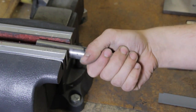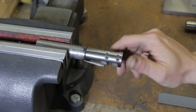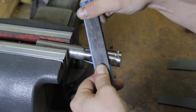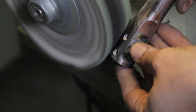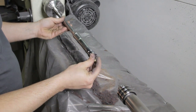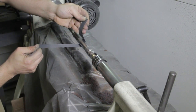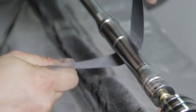With our receivers finished, we move on to the compensator, which we fixture up on a barrel stub for easier handling. Because of the shape of the comp, we have to do some initial hand polishing that can't be accomplished when we take the barrel to the lathe. Gradually we work our way up to higher and higher grit sandpaper across the surfaces of the comp, taking care to polish out any long striations or tiny blemishes. Lastly, we take the comp to the buffing wheel and polish uniformly until we reach a mirror-like finish. With the comp timed up to the barrel, we can then move to the polishing lathe to bring the entire assembly up to the final mirror finish of the presentation grade treatment. We'll also be spending extra time on the mate between the barrel and the comp to achieve the JP signature seamless blend between the two.